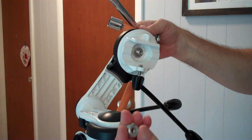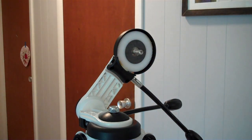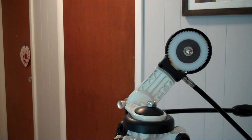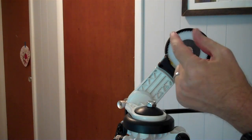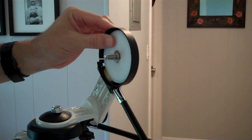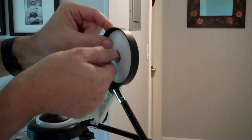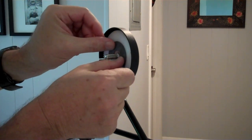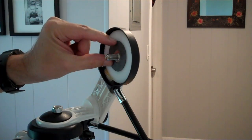So this is a nylon lock nut and a washer — don't lose the washer. Here you can see the slow motion gear train. There's just a worm gear in the bottom that spins this guy around, and it's just friction-clutched here to the actual Vixen mount. This bolt basically has a shoulder shaft that the gear will spin around, but the bolt — which is hooked up to the dovetail mount — actually spins inside the gear. The only connection between the gear and the dovetail mount is through this slippery piece of cardboard, so it is just a friction clutch.